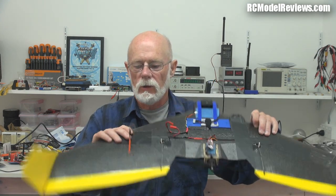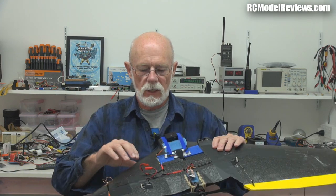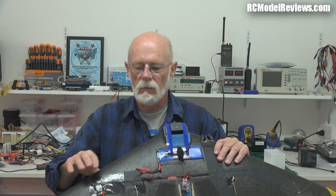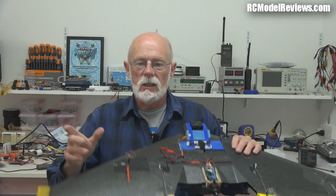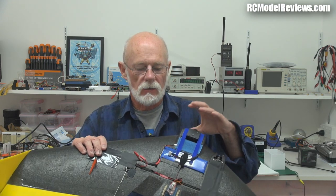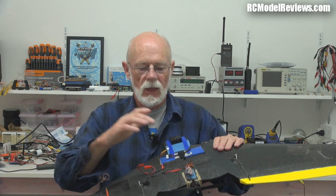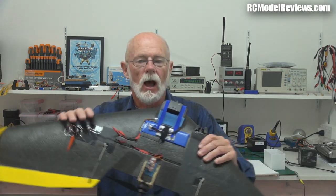Regarding the video transmitter — I've got to do some checking here. I'm using my own transmitter and I noticed quite a few fine lines on the image, which generally indicates noise, probably coming from the TBS core board which does some voltage conversion. I'm thinking maybe there's not enough filtering in there. They did send me a new Rookie 200-milliwatt transmitter, so I'll replace my own one with their 200-milliwatt and also swap in the replacement core board they sent, since the original one had pretty bodgy soldering on the wires.